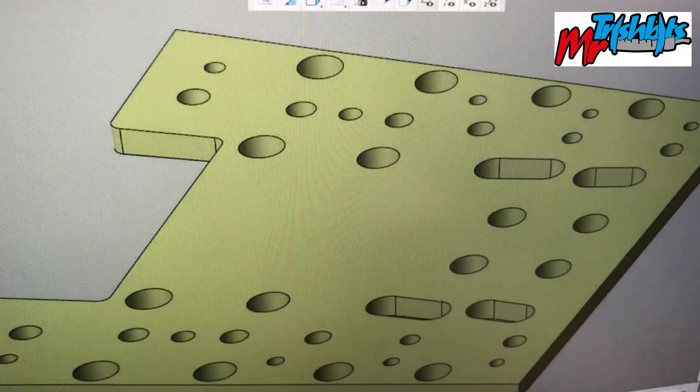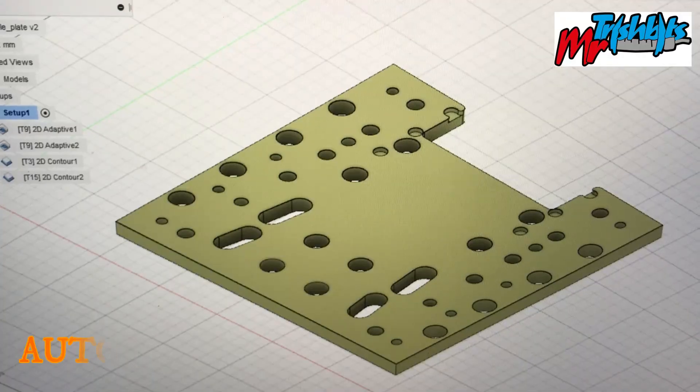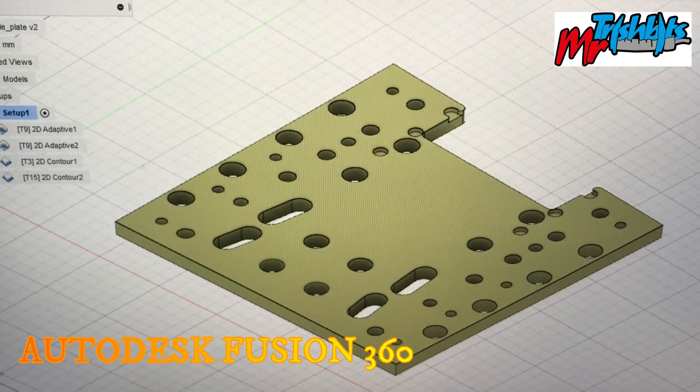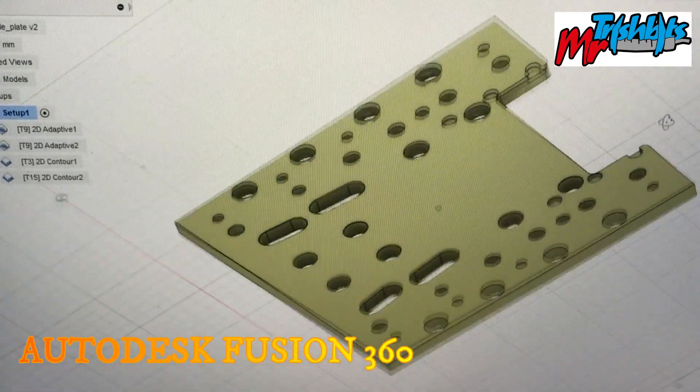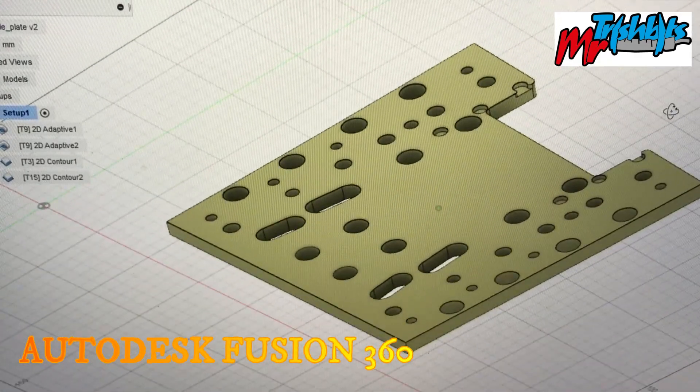So I'm going to make this from a 10mm section of aluminium and that will be pretty easy to machine. I've added six of my holes here, I did this on Fusion. I realised I needed a bit of relief to allow for some screws coming from the motor mounts. So again, I'm spinning it around, maybe give you a little look.